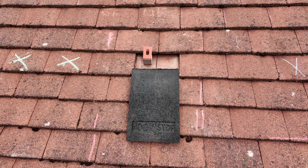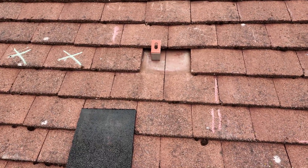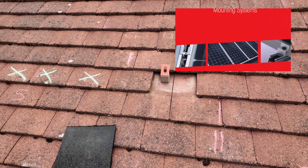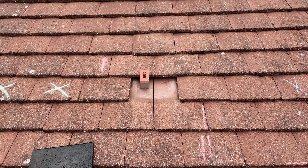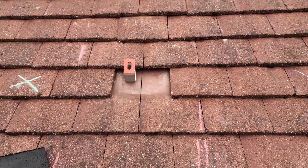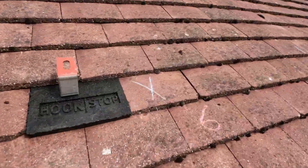We used this system a few years ago and ended up getting cracked tiles — the tile underneath where the hook stop sits kept cracking. At the time we were using the rubber hook stops but with another manufacturer's mounting system, because at that time the Red Tip — which is what this system is called — didn't have a current MCS certificate, so we couldn't use them on domestic properties. They have one now, and ironically the kit we used to use now hasn't — though that might be temporary. So this is the first time using this hook stop with the complete Red Tip system.